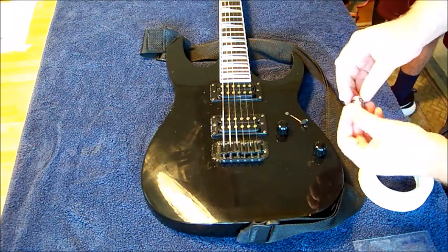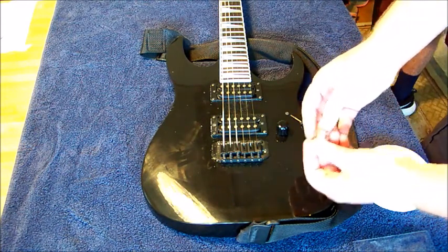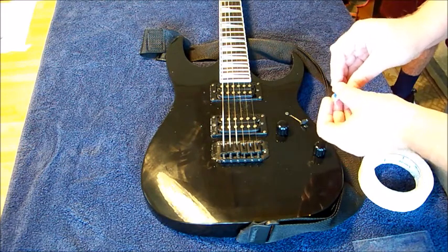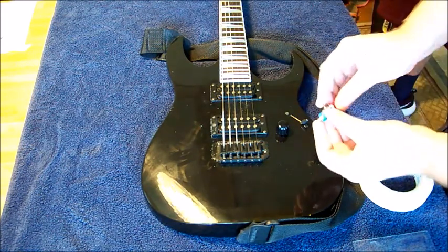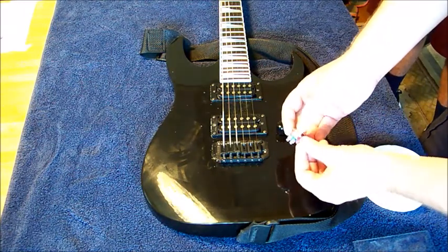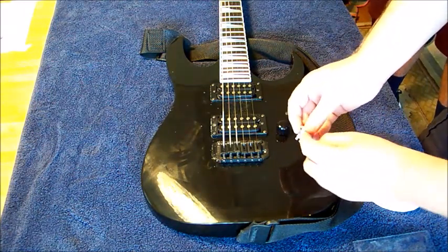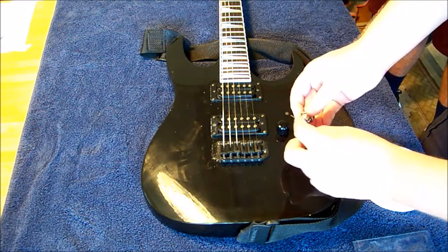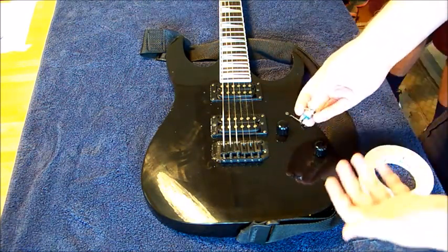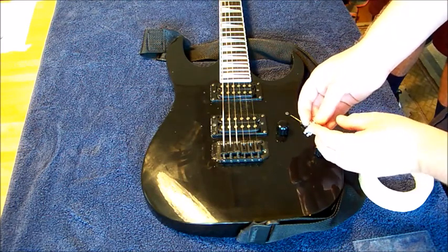He picked it up on, I don't know, Amazon. And the big thing that you want to do is get one that is normally open, right? Yeah. So normally open, the circuit stays open. Then when you press it, it connects the two lugs, so that completes the circuit. So it's normally open. You press it and it closes the circuit.